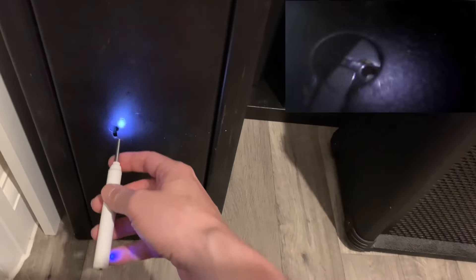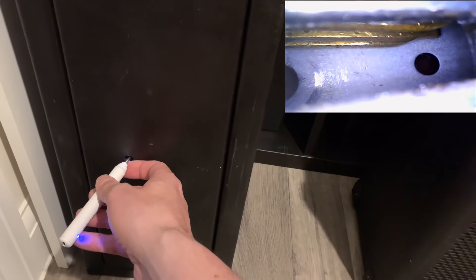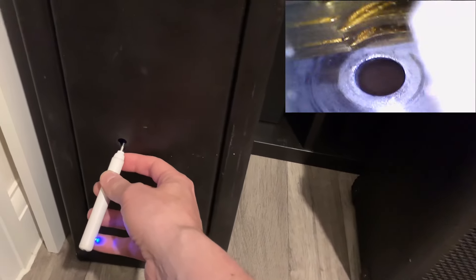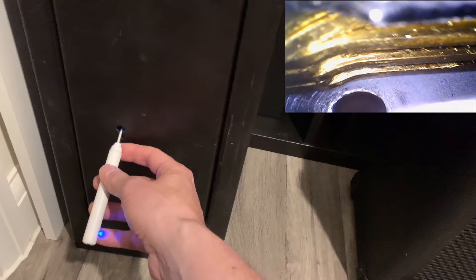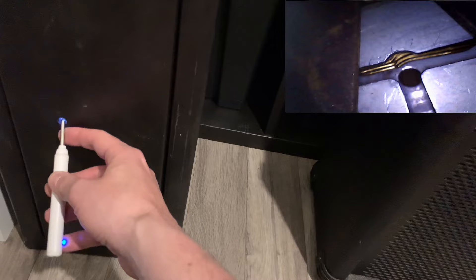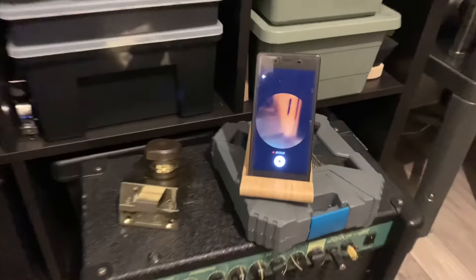This is Lowe & Fletcher with the brass levers. Looking to the right it is not key retaining - there is a notch over there but we can see it's clear and not key retaining. Always important with a gun cabinet. If we look up at the levers from down below we can see there is dimpling or stippling on the levers, which will further identify it as the Lowe & Fletcher 2802 variant. A T-shaped keyway helps as well - we can see this metal coming up either side which is hard plate. But if we look up we can also see the gates up there and the slot in the front of the lock. Pretty handy to see. That's all just checking to see if we can have this nice video overlay.